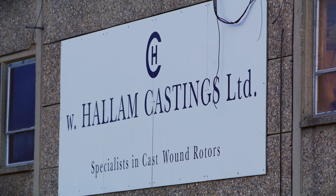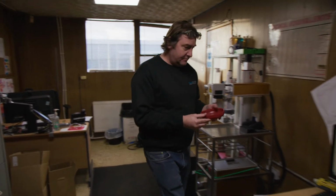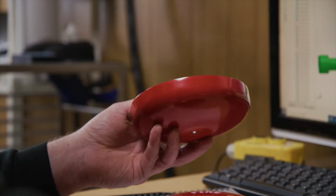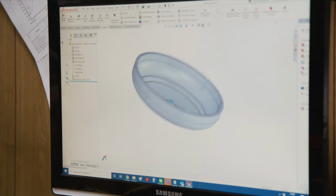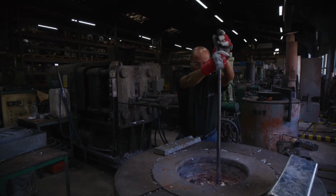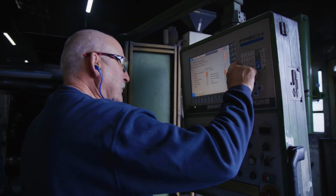Vimpex had obviously done a lot of work prior to even coming to us. They insisted cosmetically, this has got to look really good, no defects on the outer surfaces. So what we're trying to achieve is when it's cast, the actual bell gong itself is a really good solid casting. The metal cleansing, the pressures, the tool temperatures all come together to achieve the high quality frequency and the high end range that they need to achieve.